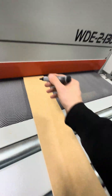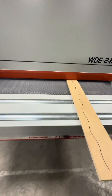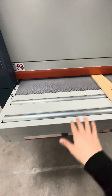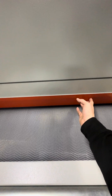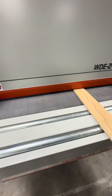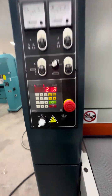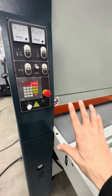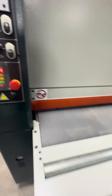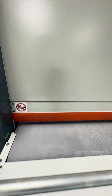I'll just pop some markings on the board. Now, for safety operation on this machine — if we press this here, the table will fall and the sanding belts will stop as well. So I'll show you that now: because the table is set, if for whatever reason someone managed to put a piece through at the wrong size, we can quickly press here, the table will fall, and the sanding belts would stop if it was operating. You then need to set the table again for it to work — if I press that again it's not going to come down. So we set it back to 16.9 and it electrically rises and we're good to operate.